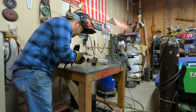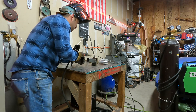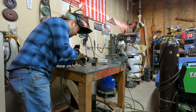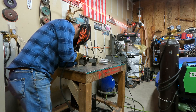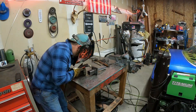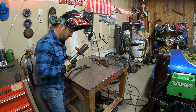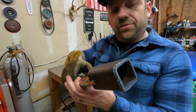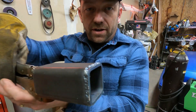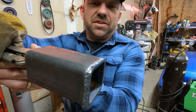Again, I take my first pass and get it down close to the fusion line. Then we go through again and get it right down to what I call the crack line. And there we can see the tube knocked off with very little material left on there — should be fairly easy to clean up.